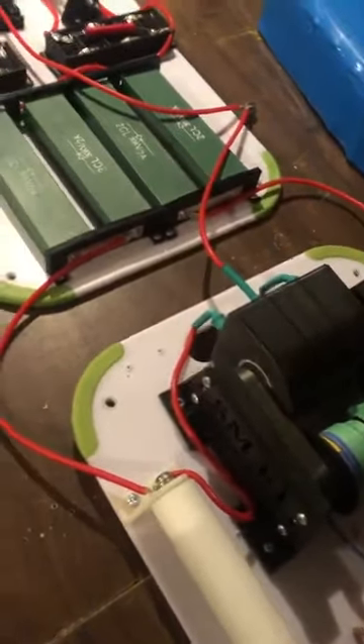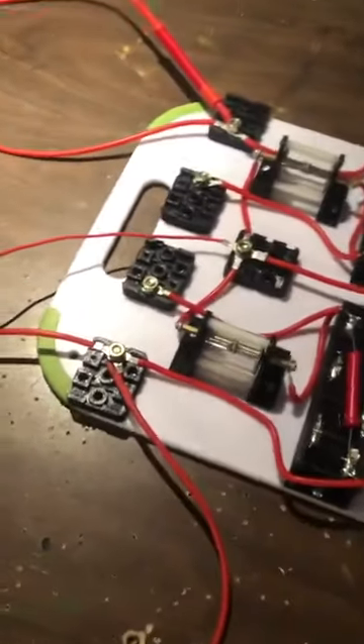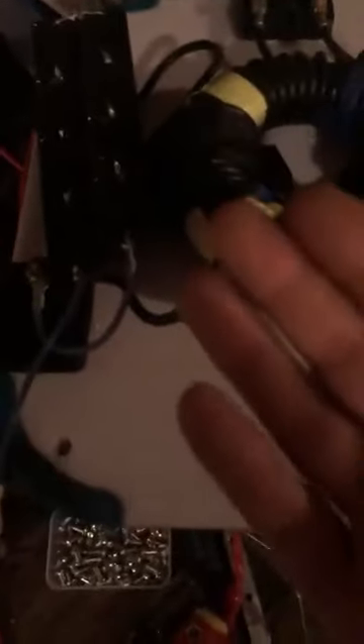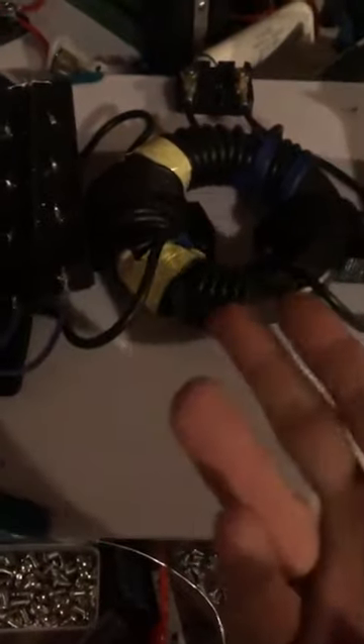Back to this apparatus here — I think we're going to adjust some turns here and on here. Not change the length of the wire, just adjust the turns again. That way everything stays true to its original design, just changing the number of turns to change the transformer action on this to give us more of what we want and less of what we've got.